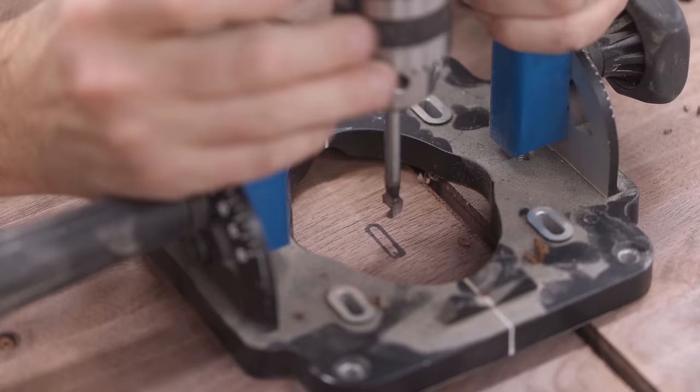After gluing up a new panel for the top I can start carving the curved ends for the tambour cabinet. I've done enough of these segmented glue-ups to know that I always get tear-out on one end, and this time was no exception. But I actually added some extra length to the pieces and made a little jig — this piece can slot down in here, I run that through the table saw to cut these ends off, and I don't have to worry about the tear-out.